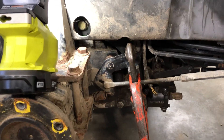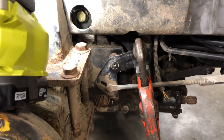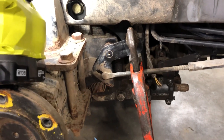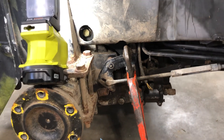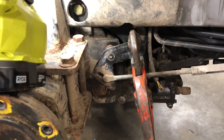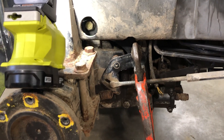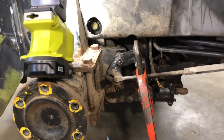That's how you unstick your brakes on one side if they're getting hung up — just operate it manually with a wrench, heat it, and use WD-40, and it will free itself up back to normal. This happens usually because a machine sits for a while, maybe the whole winter, and in the spring it's sticking. It's pretty common. This works every time and it never returns until maybe the next time you let it sit for six months. The whole job takes about half an hour including getting the tire off.